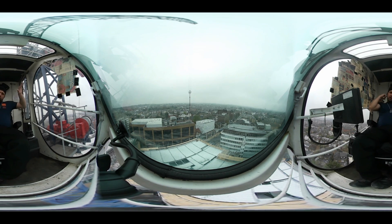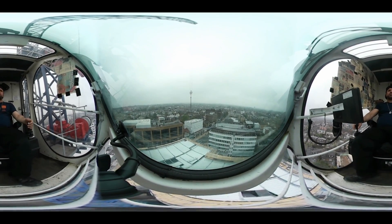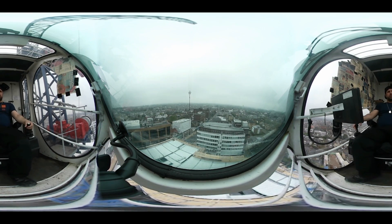So you wait for the half moon - it's going left, stops, going right. Let me make a small swing - there you go, he's swinging. Can you see it swinging? It's moving, stops, coming back, stop. Slowly it will come to an end. You want to judge 50 to 60 percent of that swing - you want to follow it the same way so you'll be on top of it and stop the whole thing. So I'm going right now - first gear, keep going, it's stopping, I carry on, but the top has to be on top of it. There you go - got the swing stopped. That's how you do it - you cut the swing.